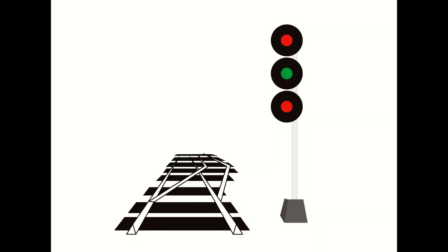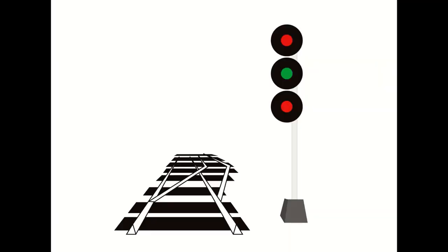The reason for the medium speed will no doubt be because at that signal, the train will pass through a switch. Now, you can't just go blazing through these switches at high speed. You'll take the train right off the rails because it can't take the corner at high speed. But this switch is designed to be transited at 30 miles per hour or less. So you pass this signal at medium speed, indicated by the medium speed head. The light is green, which tells us that the next signal we encounter will be a clear signal.